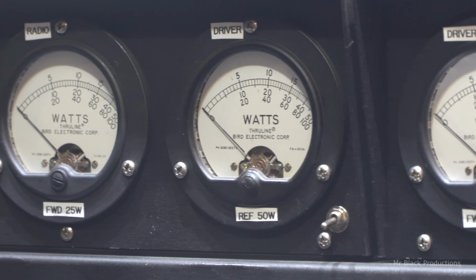So like I was saying with the RF ground, you can use 2 1-inch straps, but that 1-inch strap, if you think about it, when you bend it over in a circle, it's about the same size as your 213 coax, your 393, your 217, those styles of coax that you guys are going to run that are running a little bit higher power in a mobile. But your ground bond from your frame and your cab and your door, your reflective surfaces, your antenna, has to be at least 2 times the amount of total surface area as your coax size. This is our electrical connection ground, separate from our RF bond.